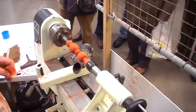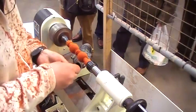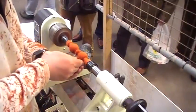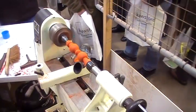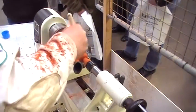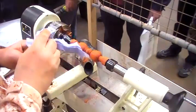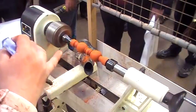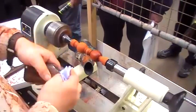I've more or less got my shape there, matching on each side, and then we can sand it up. It helps to put the extractor through it. We'll sand that up and then there's the friction polish — we'll just take a bit of friction polish and put that onto there, set it away. Get your eye protection on; I had my lung protection on when sanding. This is Chestnut friction polish, and what I do is decant it into little medicine bottles that I buy at the chemist.